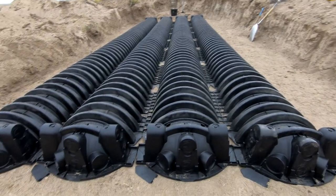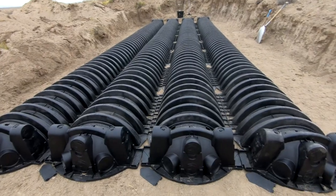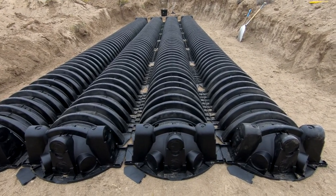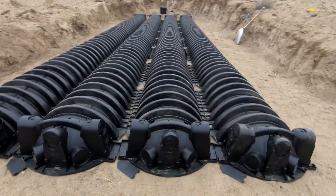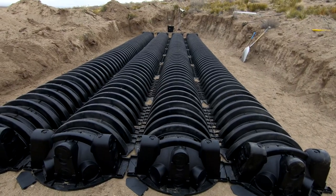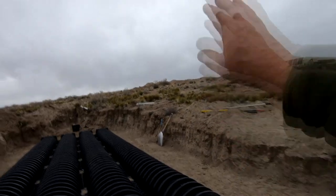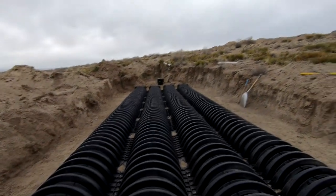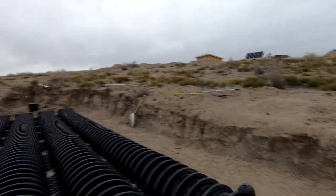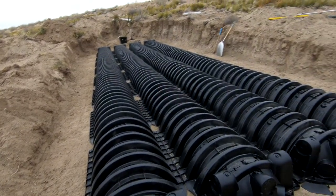The engineer does not call for a footer on this setup — I don't see it in his drawings and he doesn't mention it, so I guess we just leave these ends capped. The thing I like about this system is that if you expand — add another bedroom or something and they require a larger leach field — we already have the larger tank, and we could dig out here on either side or continue this direction someday to add on to this system. That's kind of nice.